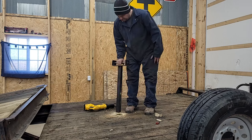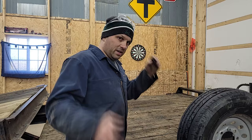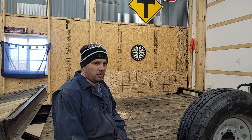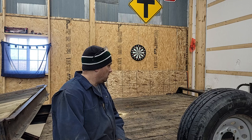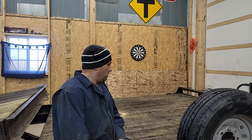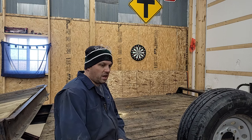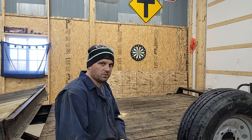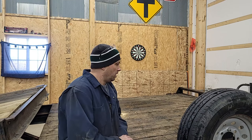Get all that done. So we still have to get a winch. I'll do a winch on like a hitch receiver, so I have to get a piece of hitch receiver too to put up there. And then some kind of cables to plug it into whatever I'm pulling. Probably long jumper cables makes the most sense, that way you can pull behind any truck and run cables up to the battery so that you have a winch to pull stuff on.